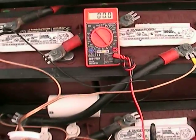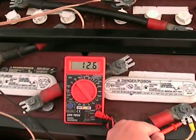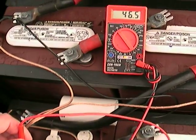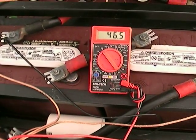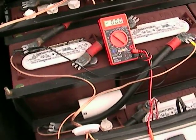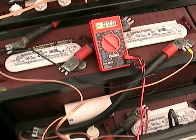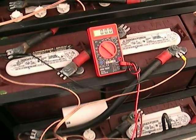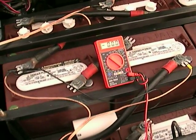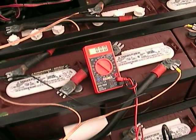Overall it's been a nice device. I've gained about one or two volts across my entire pack. It doesn't sound like much, but every little bit counts — it actually equates to a percentage or two on the pack's total charge. Hopefully after two months I should be recovering the full potential of these batteries. Even though they're used, they won't be new, but hopefully delivering their full potential in the two months it should take to desulfate them.